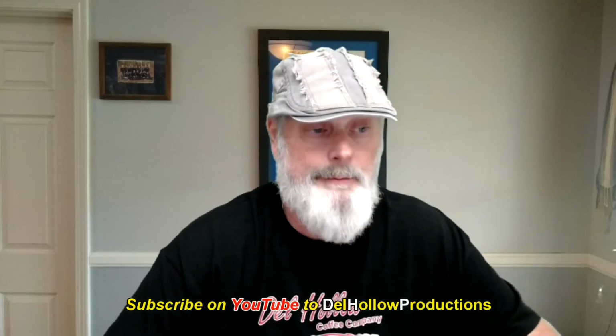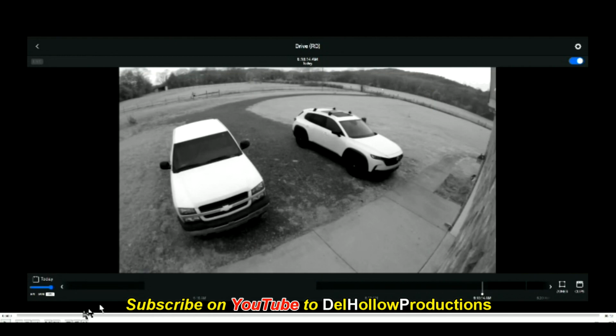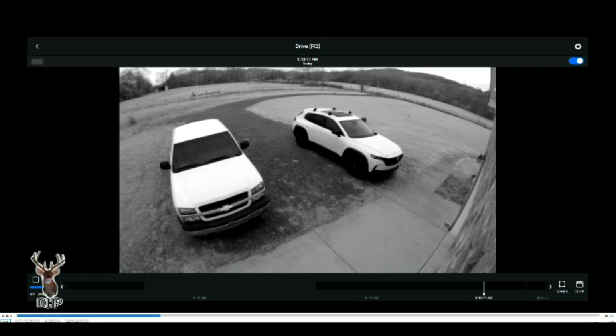Now, this particular clip is at the end of the night, and we're already just about off. Let's turn that on so we can see what we've got going on. That is early in the morning, 6:18, and they pretty much just went off. Let me roll that back. One of them is already dead, and the other one, the one closest to the road, was the one that would switch to minimum voltage early on. The other one is already gone, already dead. So we know they didn't work all the way through the night.